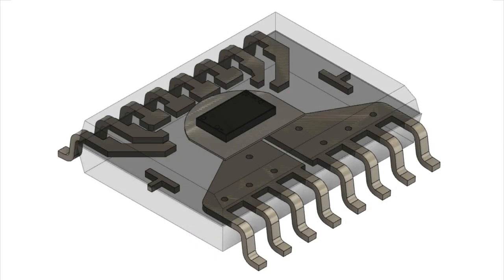So this is a really cool image you can see here. There's the Hall effect sensor in the center, and you see how there's like four pins for each connection, so you have a lot of current pass through. And there's basically a resistance. It's very low. I think it's like 0.4 milliohms. So it shouldn't affect your current draw or your voltage across the chip as much. And then there's an electrical isolation using a plastic layer between the Hall effect sensor and the magnetic plate.